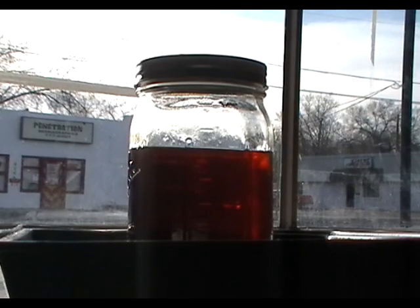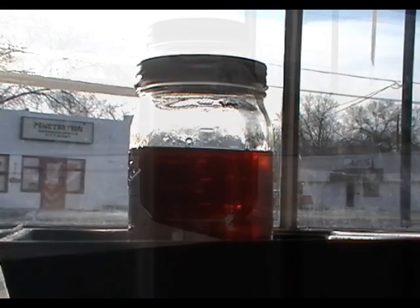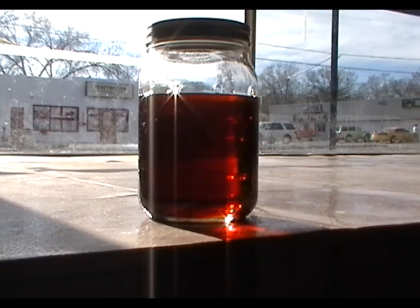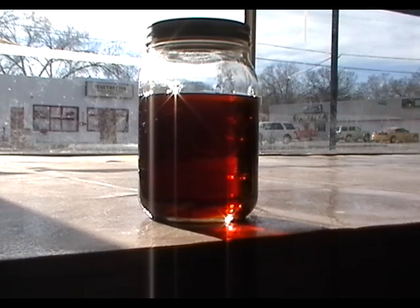It's been about five minutes and the Xylol and waste vegetable oil seem to have dissolved one into the other, so we can see that Xylol is a successful blending agent for waste vegetable oil. This is about 600 milliliters of waste vegetable oil with Xylol added to it, and it took about five minutes for the two fluids to become uniform. Agitation was not required, and after a few days of settling the two fluids did not separate, nor is there any indication of a precipitate.